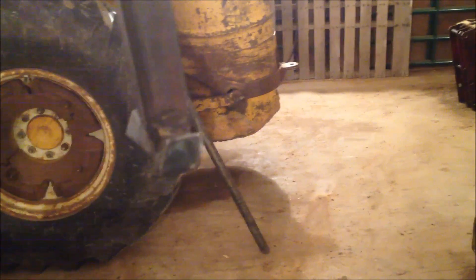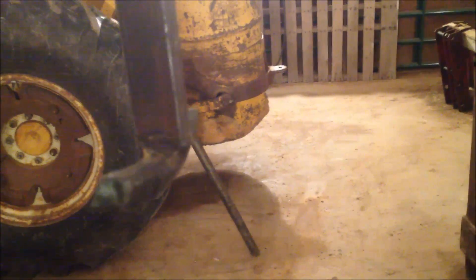Pretty much three-eighth inch bolts everywhere, quarter-inch plate everywhere I could get it, and a little piece of angle. That thing's got to be at a little bit of an angle when it meets the tire so that it works its way towards — stays towards the rim, which is pretty important. I went back online and read on a post that you need to have this kind of shape as your best bet.